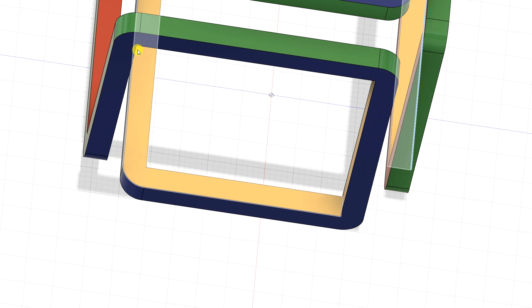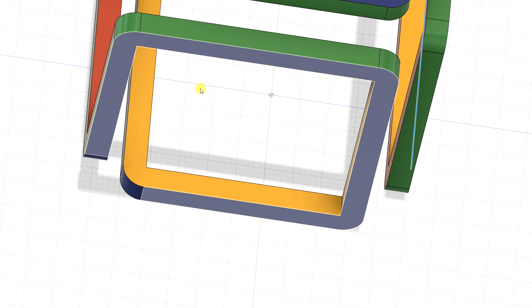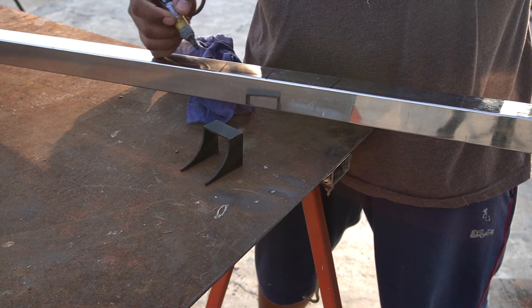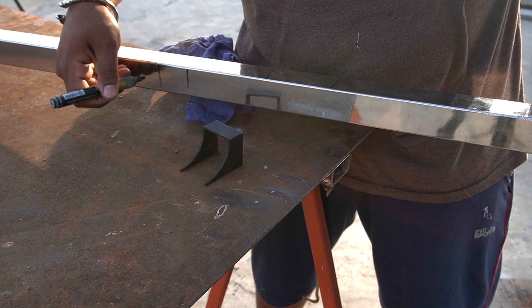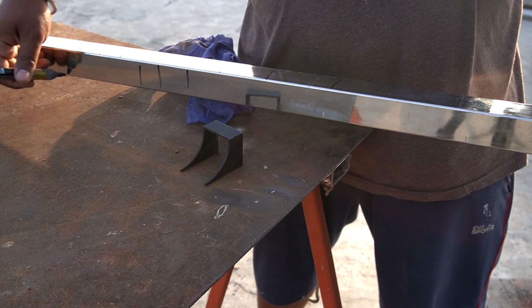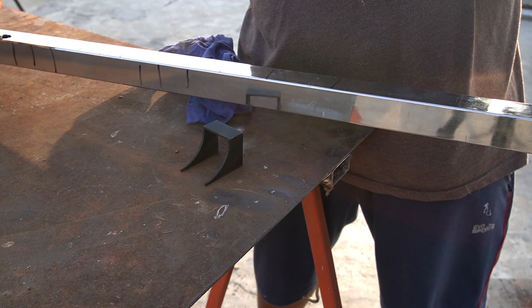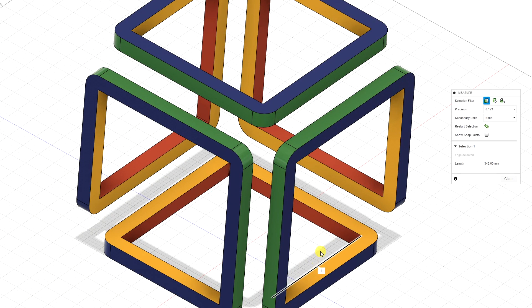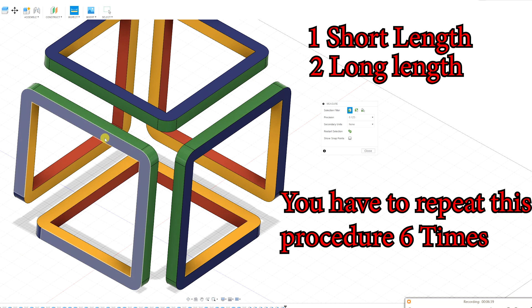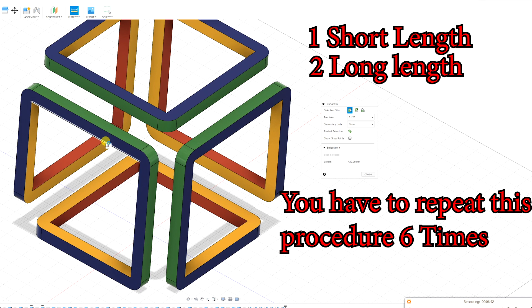You can see this on a piece of pipe: if I make three straight cuts on one side, I rotate the pipe and make three cuts repeatedly, and for the third bend I repeat the same three cuts as before. The third point is the cutting criteria for lengths. When we start from the smaller length, the next two lengths need to be bigger, then again the next two are bigger, and this repeats until the whole table closes itself. You can also see this cutting criteria on screen showing how it has to be carried out.